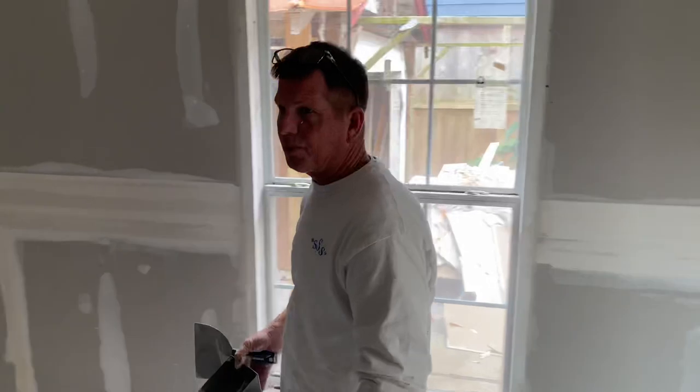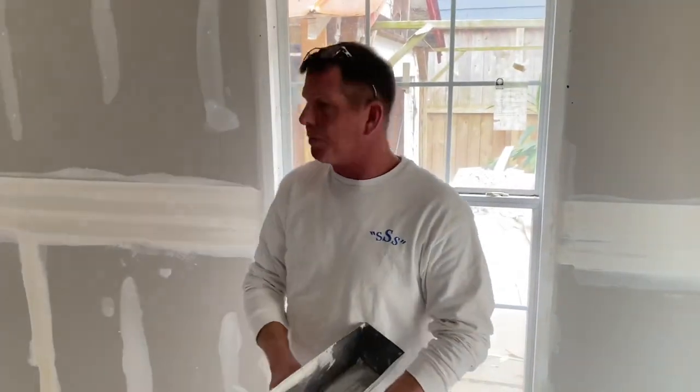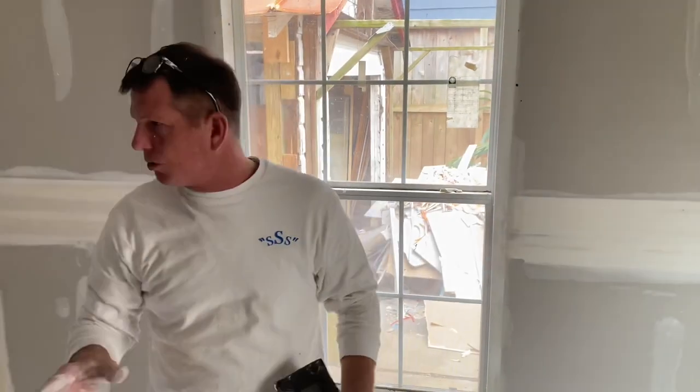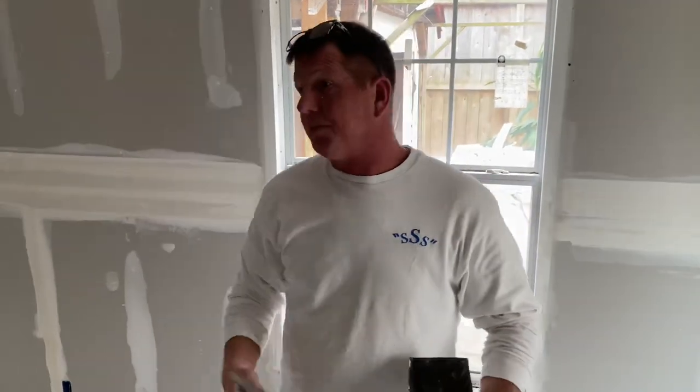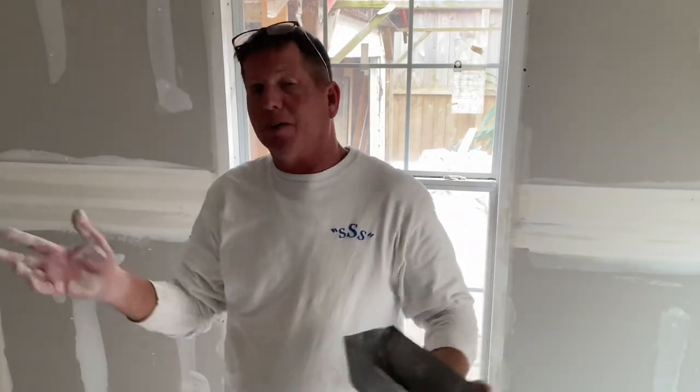All right, we'll do some more. Another video here shortly. But that's the gist of it. So No-Coat corner bead, in my opinion, best corner bead you can ever buy. It's got a lifetime guarantee, it never cracked. There's no other corner bead that does that. So that's my thing. There's no metal in it, it can't rust, and it's got a lifetime guarantee. It won't crack. I mean, I'm all in.